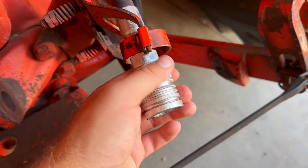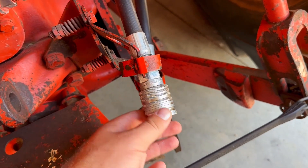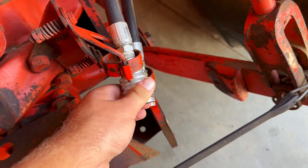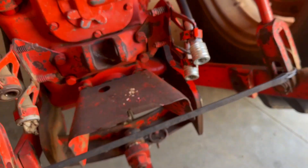They work great. The only problem is they're not breakaway and they're not actually built for this tractor, so it's really hard to hook up because the collar pushes back but nothing's holding it - it's a real pain to hook up implements. We might figure something out someday, but as far as functionality it works great. I didn't do the other remote because I don't run anything requiring more than one remote on this tractor - I only run a rake and a tedder, it's only 55 horsepower.